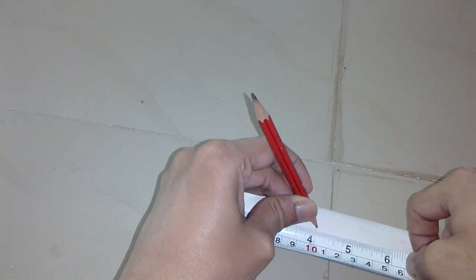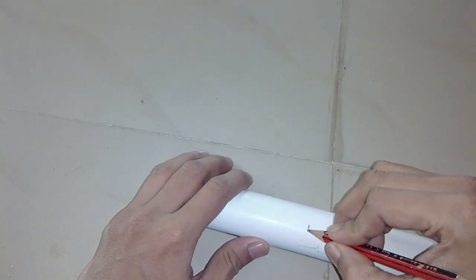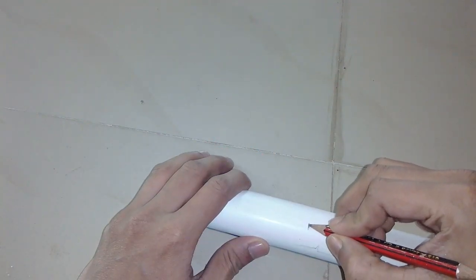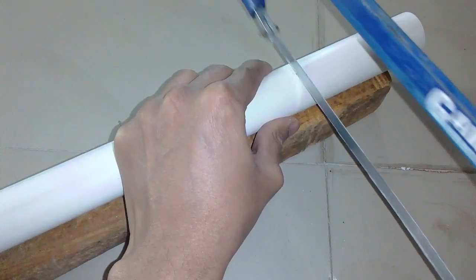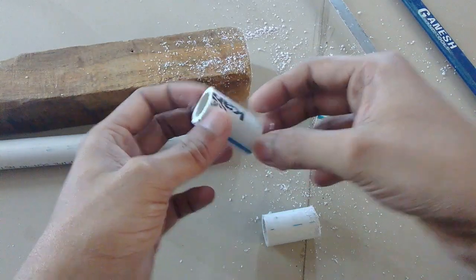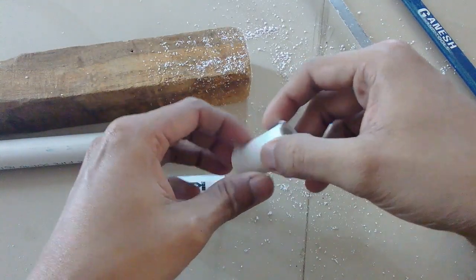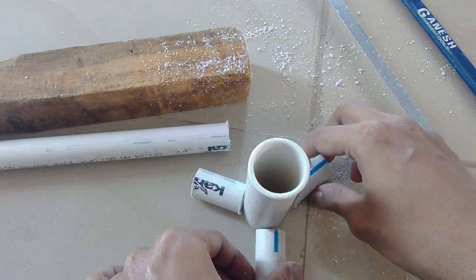Now I'm going to make the center hub, which will hold the legs and everything else in this tripod. To make it, I'm going to use a 4-inch length, 1-inch diameter pipe. After cutting, sanding and deburring, it was ready. Along with it, I will need three 1.5-inch length and 1/2-inch diameter pipes. This will support the legs on 3 hinges.